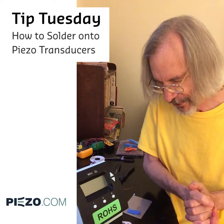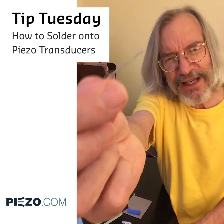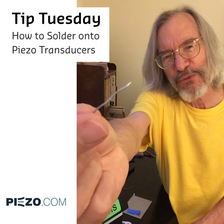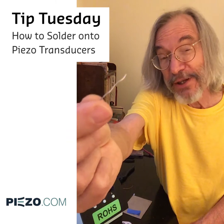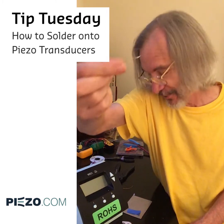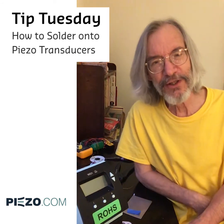You can get the kit we sell that has flux and solder. Don't use big fat solder, and I'd also recommend you use RoHS compliant solder that has no lead. If your prototype ends up working it's going to go into production and you'll have to use this stuff anyway, so just get it and use it. There's nothing wrong with any of the joints it makes — it works just as well as the old tin-lead solder.